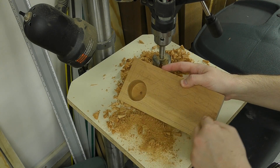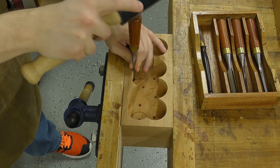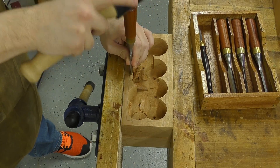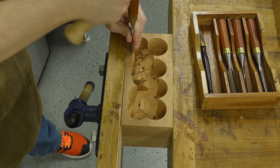There's one hole, and I'm just going to continue going along and drilling out the rest of this. My goal is to make sure that I've got as much removed as I can get before switching over to the router — it just makes things a little bit easier.